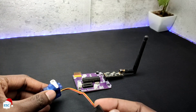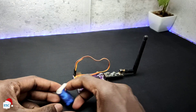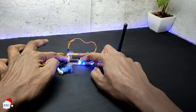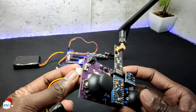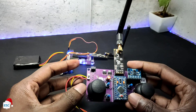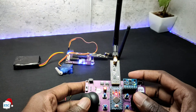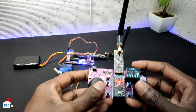For the first test I connected a servo motor to one of the PWM channels. Then I uploaded the transmitter and receiver code and now you can see it working. Remember to remove the motor driver from the socket while using the servo pins.